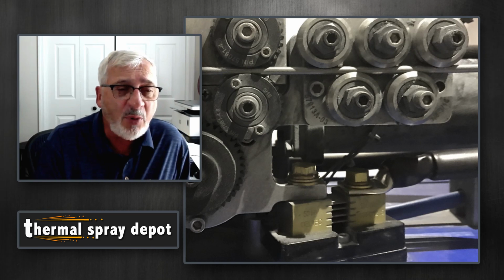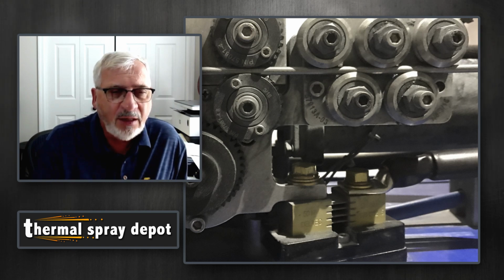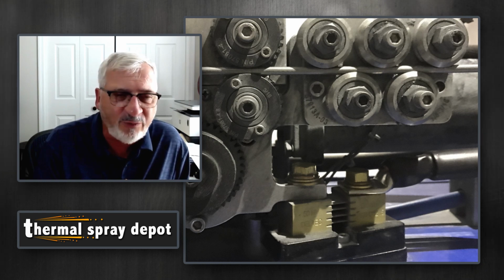You see the bottom part of the picture, there's two brass blocks, and there's two bolts there. That's called a fusible link, and that's capable of carrying 500 amps of DC current. Well, you've got to make sure these fittings stay tight and the connections stay tight.